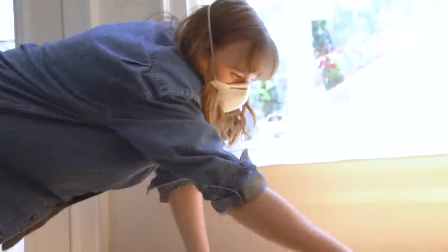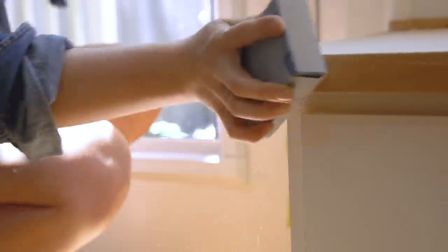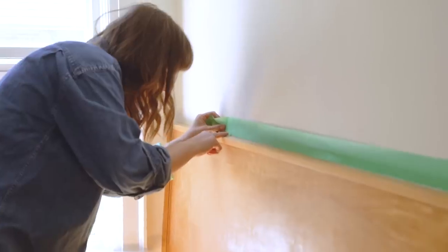So while I sit with that, let's start priming the bench seat so it's not this ugly wood anymore. I'm going to first give it a quick sand to rough it up and make the paint bondable, and then we can go in with our primer coat.